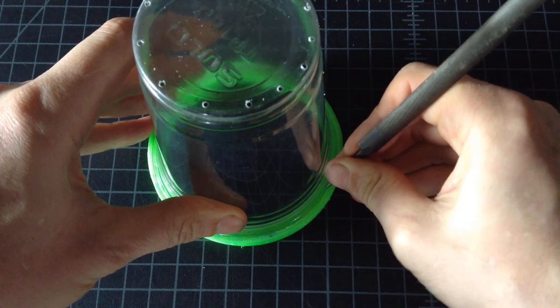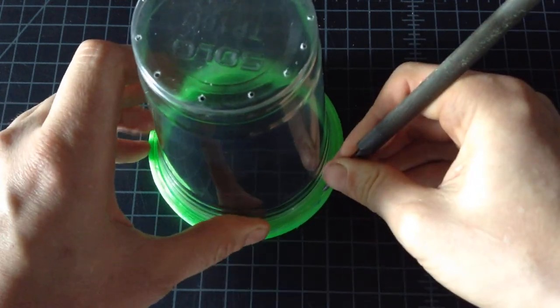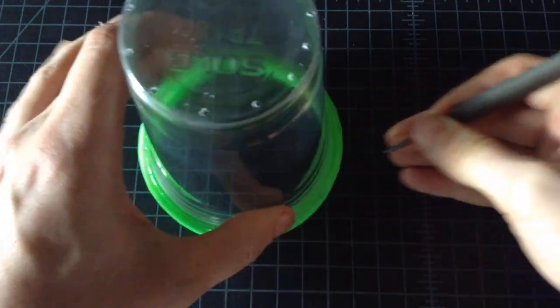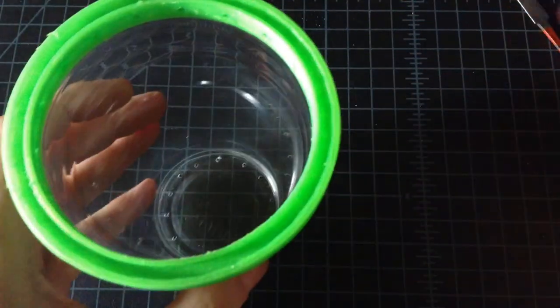And this is the bottom side, the tape side of the printed part, and it's going to have tighter tolerancing than the top side, which is going to be a looser fit. So once your part stays fully assembled and doesn't pull off, you know you're good to go.